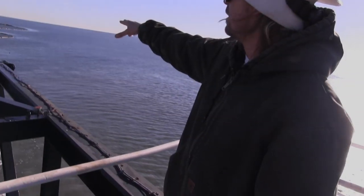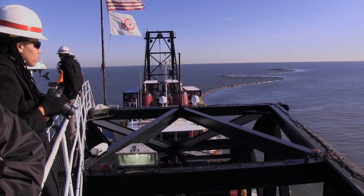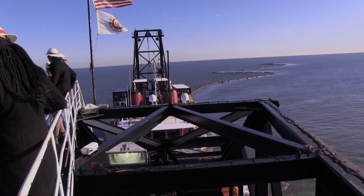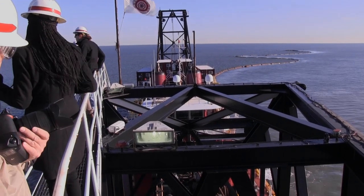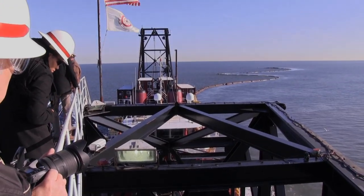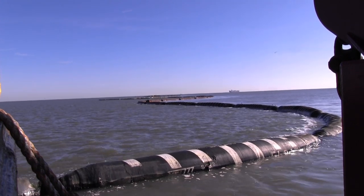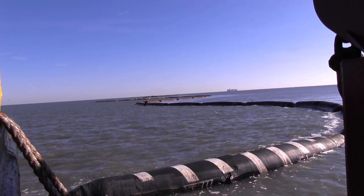We've got about 1,800 feet of float hose behind the dredge. There's a pipe that runs into the main pump, out the side, and then the sand gets pumped through that rubber hose. That rubber hose is like our leash — we've got about an 1,800-foot leash. So after we reach the max of it, which we just did, see how right now there's some slack in it — it kind of makes a mess. We had moved back to another cut, because once we start moving forward, we'll run out of slack and then we've got to move back.